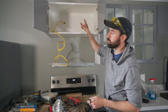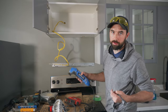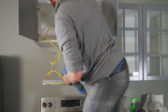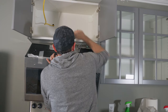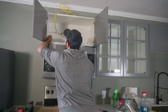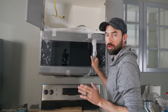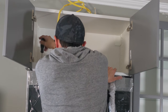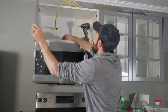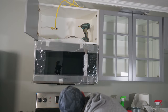The back cut is a little tight to the backboard of the cabinets, so I'm switching to a multi-tool with a wood blade — it's a slower cut but fits in that tight area. That turned out pretty good. Once I tighten these bolts down — I think I may have done it. Looks great, nice even space at the top. Now all I have to do is install the venting out through the wall and hook up the electrical, and that's it.